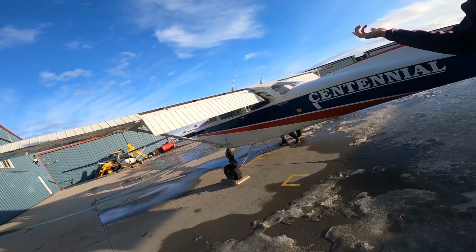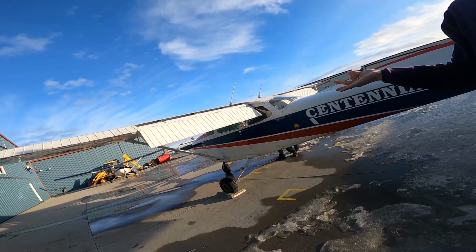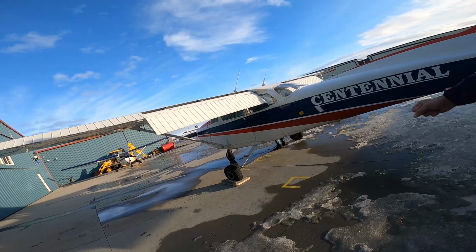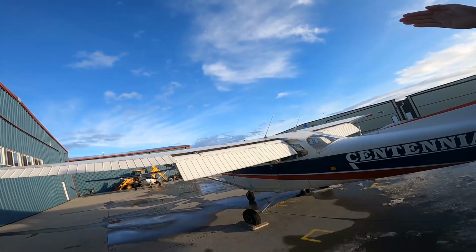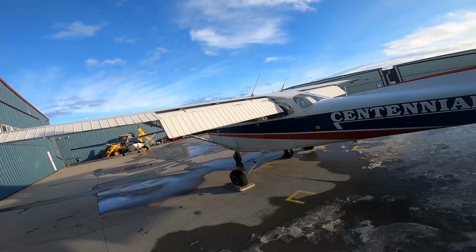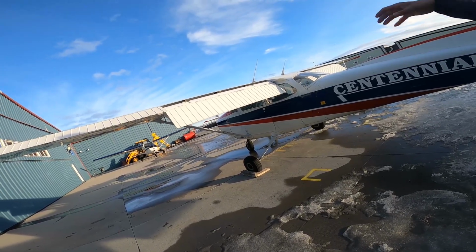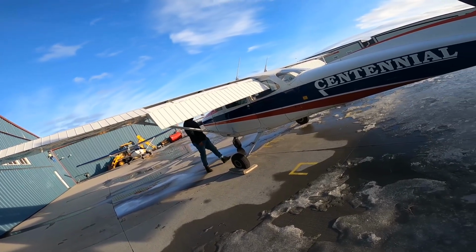If there's planes outside, if there's accumulation of snow, frost, you can't fly with contaminated wings, right? It's not a good idea, believe me, to fly with contaminated wings. So you want to be mindful of that as well. Okay. Make sure you close the caps tight. If you can see from here, the little handle faces straight this way. You have to make sure they're tight, because if they come open in flight, like Bernoulli, you know how it goes from high pressure to low pressure, the fluid, your gas will come out, and so you have to make sure your caps are tight.